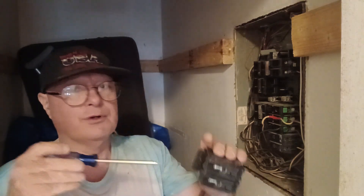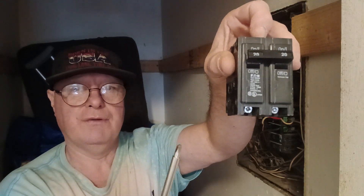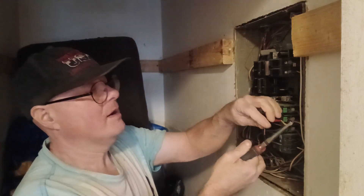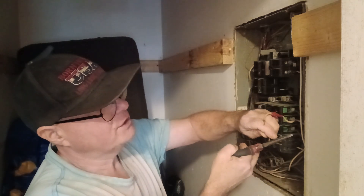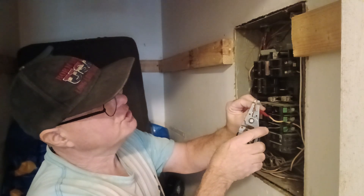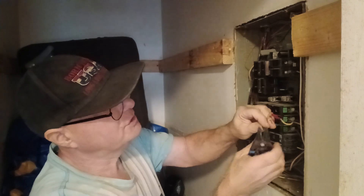This is just to show people that this wire is being used as live rather than a neutral. We're going to use our Robertson square-head screwdriver to tighten our terminals down. We'll cut these back a little bit because they're a little long — you don't want too much copper sticking out behind your breakers. And we'll clean the strip ends; they look like somebody stripped them with a pocket knife, so we'll give them nice clean strips.